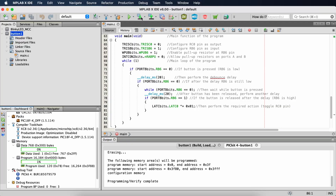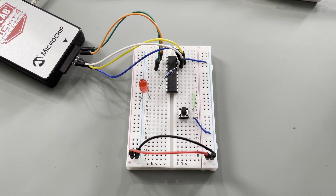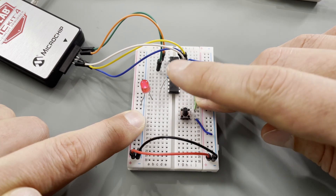That's all this microcontroller is doing — waiting for a button push, doing those debounce checks, toggling the LED, and waiting again. It's not using the microcontroller to its greatest potential, but sometimes you just need something simple. So let's actually program this thing. Programming verify complete. Now we can test it out — push on, push off, push on, push off.